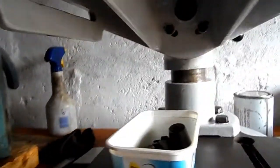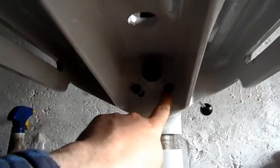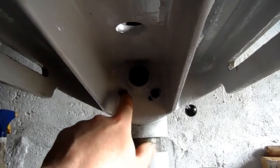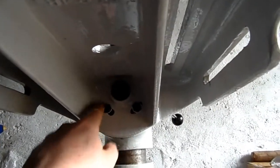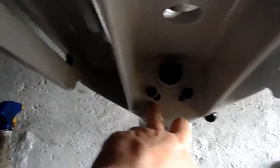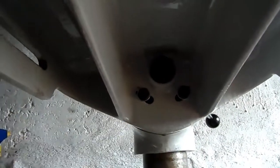So one of the first things I realised I hadn't updated you on when I reviewed my most recent uploads is the fact that I've now got the table mounted back onto the table bracket. I was missing one of these bolts. They're 5/16 BSF by 1 inch long, so I ordered up a few online and I was waiting for them, so that took a little bit of time to come. It wasn't too long. I've got them mounted now. That's brand new bolts, so they threaded in lovely, and it looks just a job now, eh?